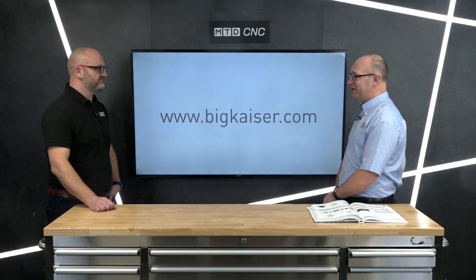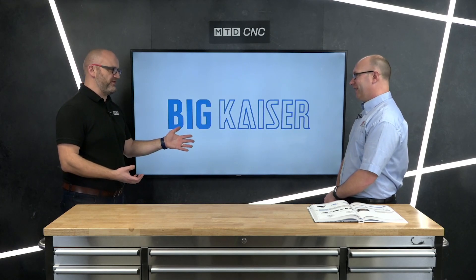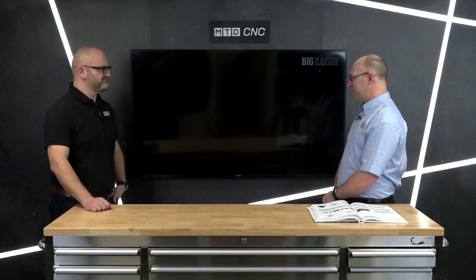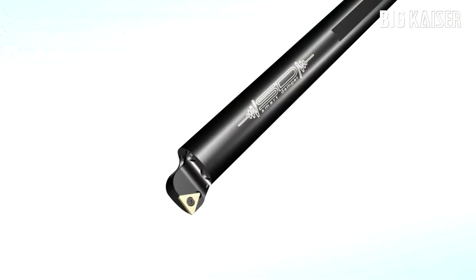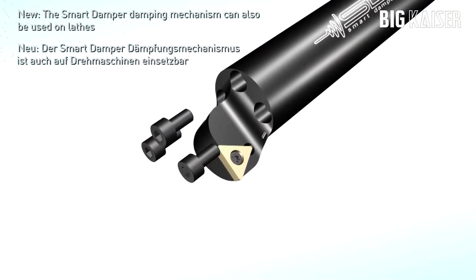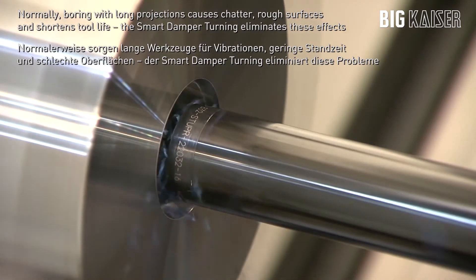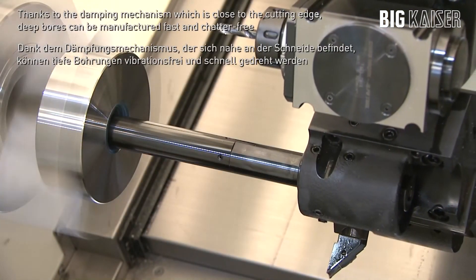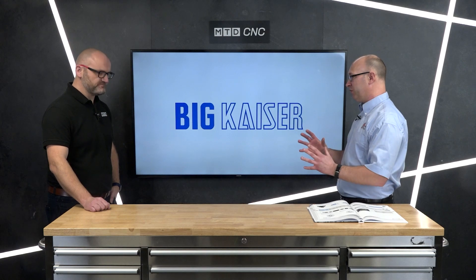The range runs from 20mm all the way up to 203mm — a very good range of sizes. In terms of machine interface, Big Kaiser is very well known for their tool holders, so it's a good marriage: Big Kaiser back end, Big Kaiser front end, and the damper in between. If you've got applications like this, give us a call — we've got a really knowledgeable guy called Simon Yeomans, the Big Kaiser specialist in the UK. He loves getting out to see customers and will put tooling assemblies together for your specific application.